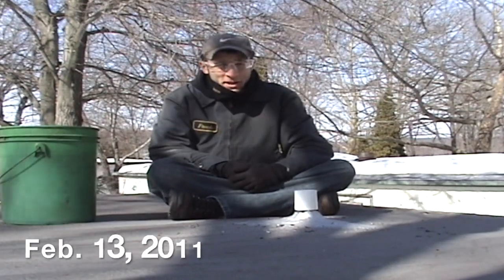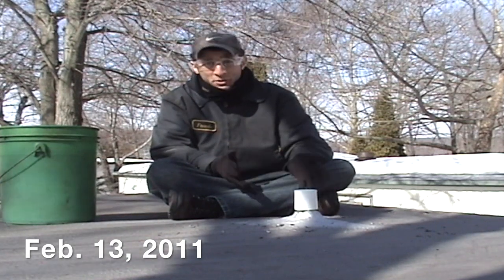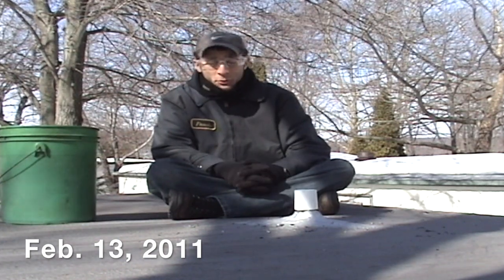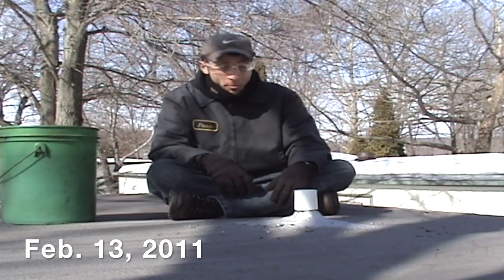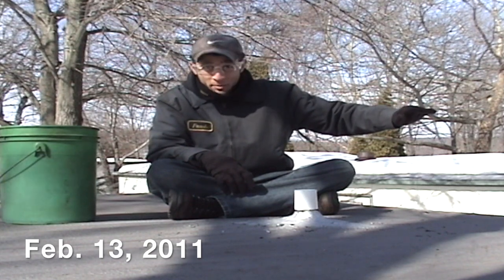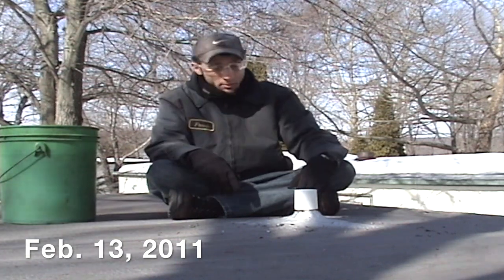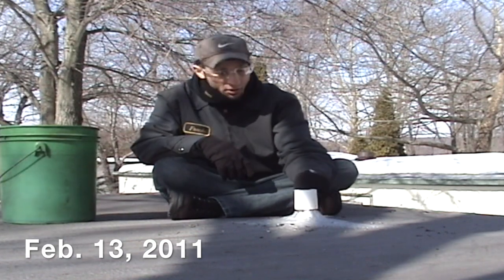Sunday, February 13th. It's the day before Valentine's Day. And I'll show some love by giving my house some love. Right now I'm on the roof, as you can see, trying to fix a little roofing problem. Two weeks ago we had a really big snowstorm, and there was about 2 feet of snow on my roof. And my pipes downstairs in the house obviously got clogged up because the snow was covering the vent. So what I'm doing today, it's nice weather, is I already started to cover this up.